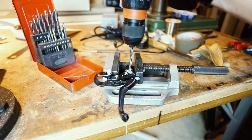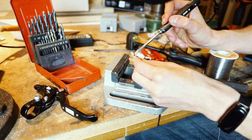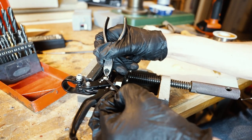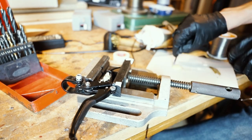The next thing I did was improve the electric brake. This e-scooter mainly relies on the electric brake, and there was only a reed switch — basically an on/off switch — inside the brake lever for detecting if the brake is pulled. I want an adjustable, analog brake rather than a digital one, so instead of the electric brake just slamming on, I want to gradually increase the strength. I pulled out the old reed switch and put in a new hall effect sensor. The magnet was already in the brake, so I didn't have to do much work — just ripped the old sensor out, put the new one in, and now I have a great analog signal for braking.